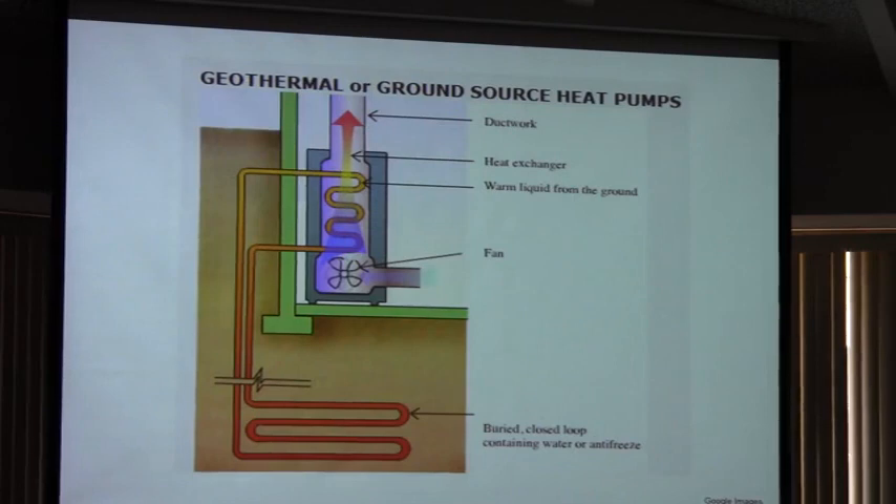This is a little drawing for anyone not familiar with geothermal. Basically you bury your loops in the dirt and they contain an antifreeze-type liquid. It then generates either cool air or hot air, whichever way you need it to go. If you dig a hole about five feet down, it'll be about 70 degrees. So our heating and cooling system uses that 70-degree earth temperature — you're just heating or cooling a little bit versus working against 95 or 35 degrees outside.